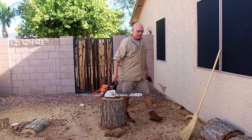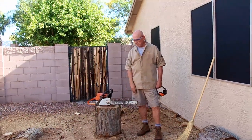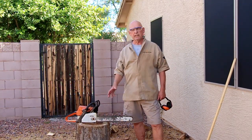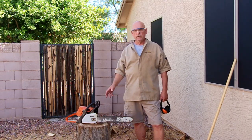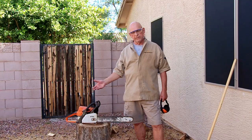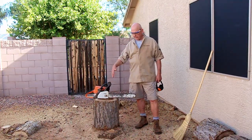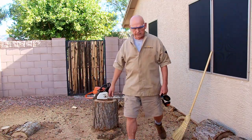The chainsaw I'm using — I've experimented with different ones — is a Stihl with an 18-inch bar, and it has sufficient power. 18 inches is pretty good for what I use. Sometimes I'll tie into a log with a diameter of 20 inches or more, and then you end up having to do a double rip cut, which is a little tricky, but if you do it long enough you develop a skill so you can get the whole inside surface flat. Now let me mark where I want to cut this.